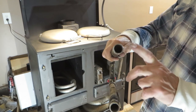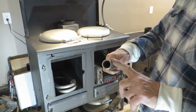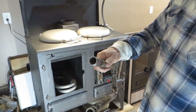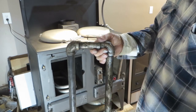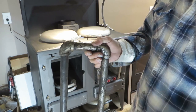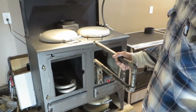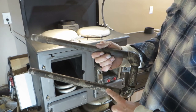Key is the inside of that pipe - as you can see it's small diameter. If you have any kind of scale or minerals in your water - and you can tell this if you lift the lid on a teapot and it's all white and built up - that's what will happen in here. If you look at the dynamics of this, you have a very small surface area, just a tiny flat surface at any one point because it's radiused. When it's in the fire, the infrared rays are hitting basically a round shape and ricocheting. Infrared is what transfers the energy from the fire to the water.